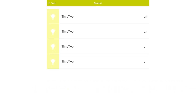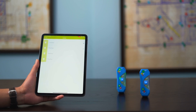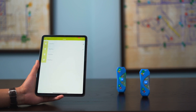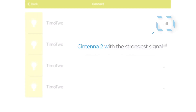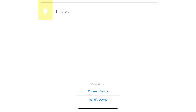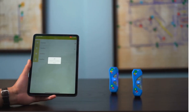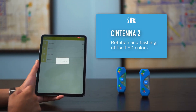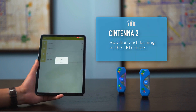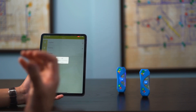We have multiple devices here because we have a few in the building. So we want to ensure that we identify the proper Centena we're trying to update. We do that by starting with the Centena with the strongest signal, as it's usually the one closest to you. Select that and hit Identify. What you'll see is a rotation of the colors of the internal LED and flashing of your indicators.